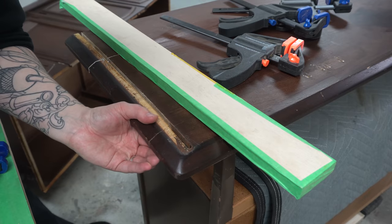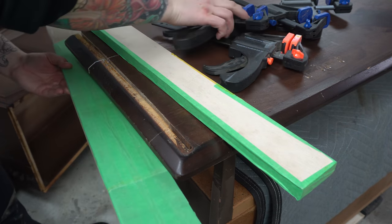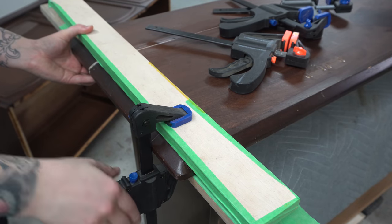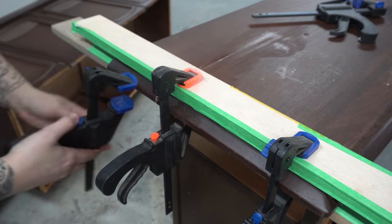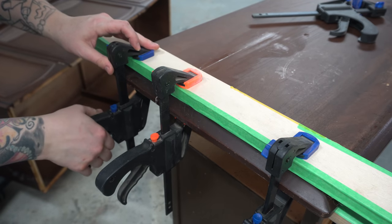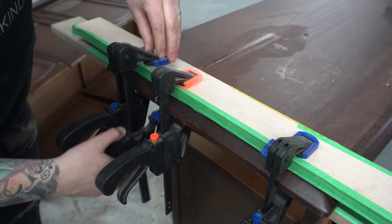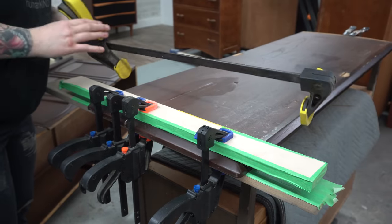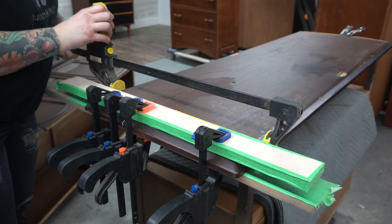There's another small crack there — I checked, it's not moving at all and it doesn't go down the board very far, so I'm just leaving that one as is. I am sandwiching my piece of wood between two boards so that when I clamp it, it will somewhat straighten the board at least where the crack is. I want to make sure that at least the part I'm gluing is going to be as straight as possible.